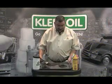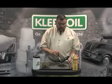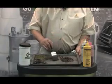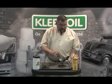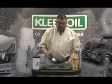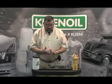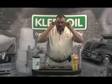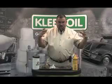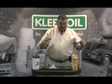Now I'll tilt this paint up a little bit. You can see that all of the transmission fluid has also been absorbed in this demonstration. We've already used this pile to pick up a big oil slick, and now I'll fill the middle with the red transmission fluid — and it absorbs it without even agitation. When I say it's the most powerful absorbent, it's also the most powerful wicking agent, which gives it wicking power without moving it around. So you can literally surround a spill, create a berm, and prevent that oil from escaping.